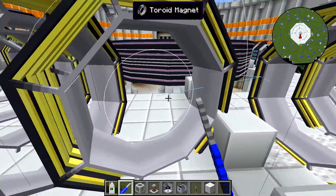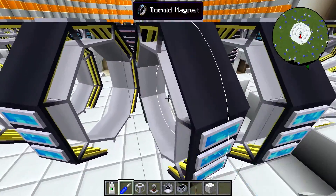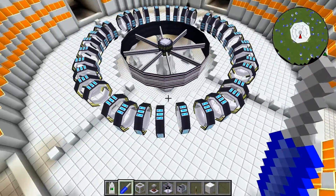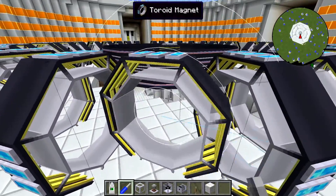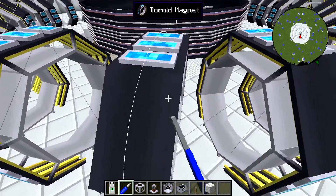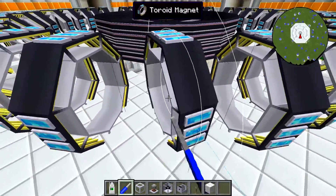You can see it better in the middle — that blue line needs to be pointed towards the center, towards the solenoid. If it's not, then it's not going to work. So all of these are turned the exact opposite direction as they should be, which means I've got to rotate them all around. You can do this without the visualizer torch in the middle, as long as you just point the arrows as close as they can get to the center of the solenoid. Just make sure when you rotate these that they are indeed rotated the proper direction.